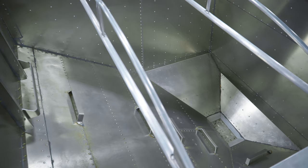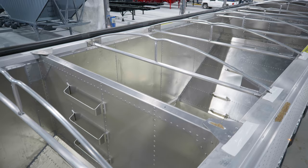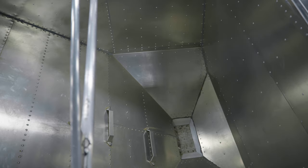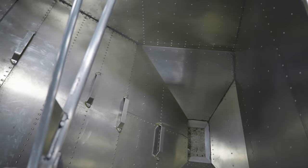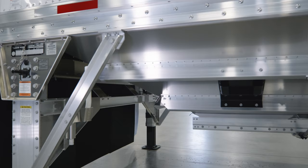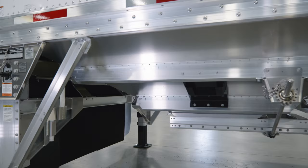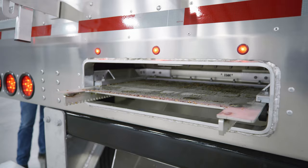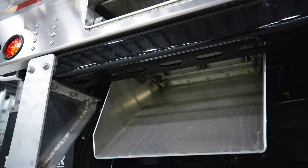A little bit about the inside of the hoppers — I mentioned there are three. The two slopes in the front of the hopper are 33 degrees and the slope on the rear is at 35 degrees, giving you lots of slope to clean out those hard-to-move products. The front two chutes are our standard new chute design featured in the Distinction Series on all our trailers, with a 16 by 24 door on a roller frame. We've incorporated that same design with the rack and pinion on the rear door, which is 22 by 12, giving you lots of clean-out at the back of the trailer.